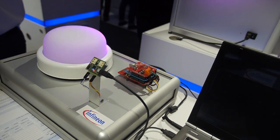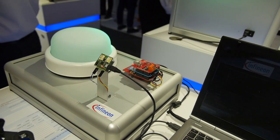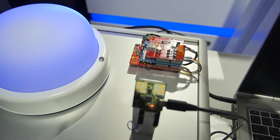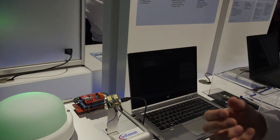The firmware enables communication via I2C between both boards. You can select the LED engine and communicate using different commands to program the color and brightness. The technology enabled by the 1200 family is called the BCCU — the Brightness Color Control Unit. It's a dedicated unit, a kind of co-processor, that does autarkic color control, flicker-free at low dimming frequency, and is very cost-effective because it's a fully integrated solution requiring no external components except a FET for the whole lighting control.